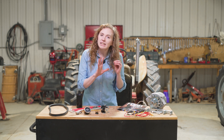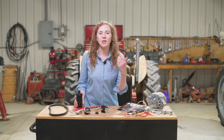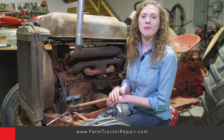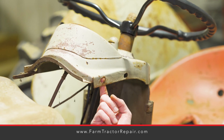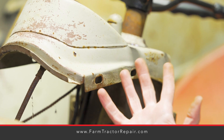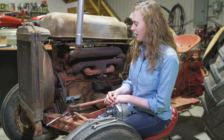It'll be a clean, simple, neat wiring harness that's on the tractor. It's just going to be all around so much better, so follow along with me. As you can see, I took the hood off of my tractor, and you can do the same. If you've never taken your hood off before, make sure that you remove the bolts that are on the inside of the dash. Those are often overlooked, and if you don't know that they're there, it could be really frustrating, but you'll know to look for them, and you can take those off, and then it'll free up your hood to come off the rest of the way.